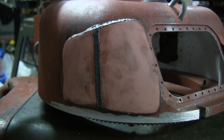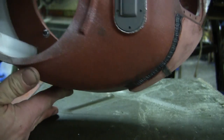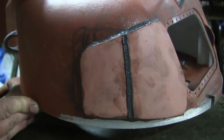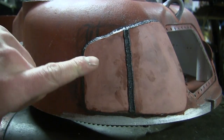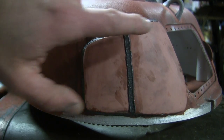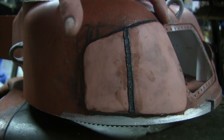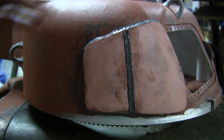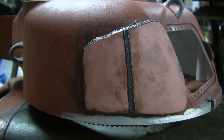The reason for that is that due to the shape of the Sherman's turret, you're going to have a lot of round curvature angles to deal with. Getting a piece of plastic with this thickness to bend the contour around this geometry is very difficult to do. So the sculpted technique was utilized. This is actually pretty unique, as this is the first time I used this technique on a model, specifically for a component that's this large.